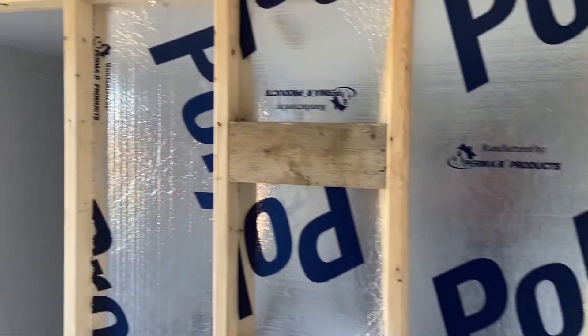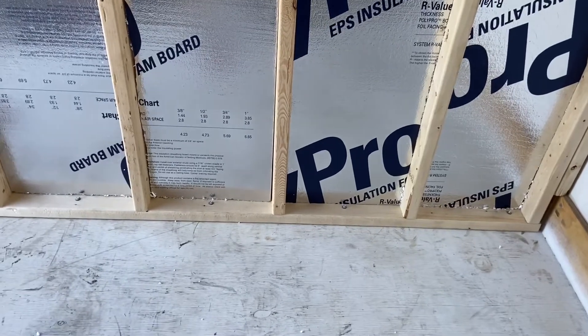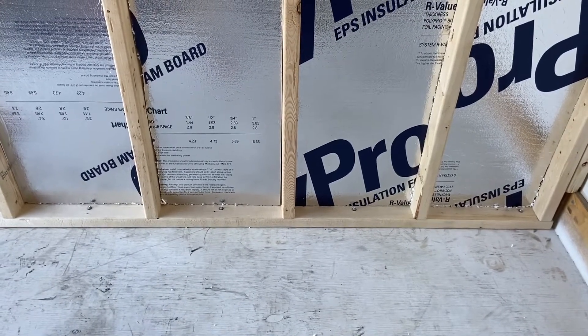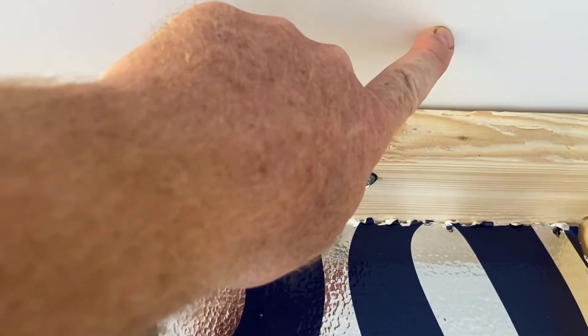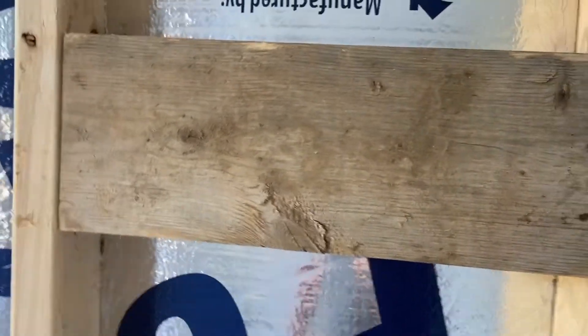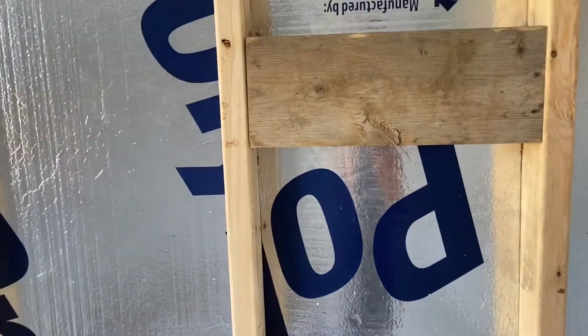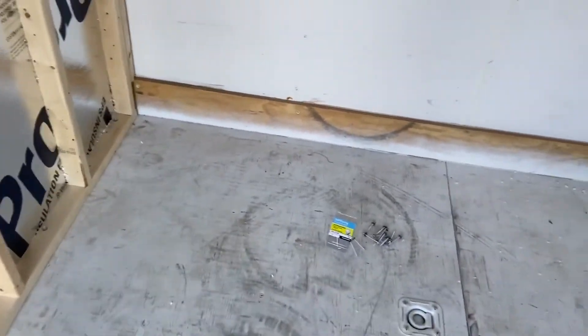All the boards are pressed in. At the bottom, those are self-tapping sheet metal screws — the toe plate is lined up above one of the steel cross members underneath the plywood. At the top, we also use those same screws to go through the roof material and into the steel beam across the ceiling. There's a two by six block put in here so that I can mount a TV to it. In this room I'm going to build a twin-size bed that flips down from that wall, shelves for clothing storage in the corner and along that wall. When the time for the floor comes, we're going to use LVP as it's waterproof — and going to Kansas, there'll be a lot of snow and ice to deal with.